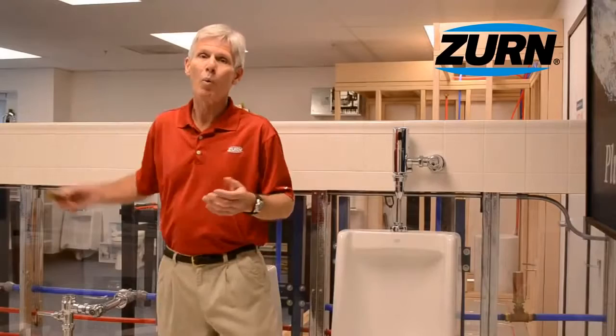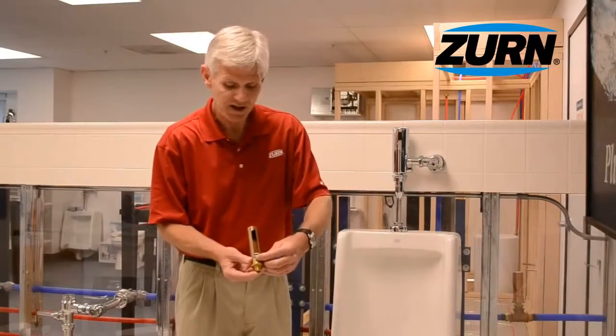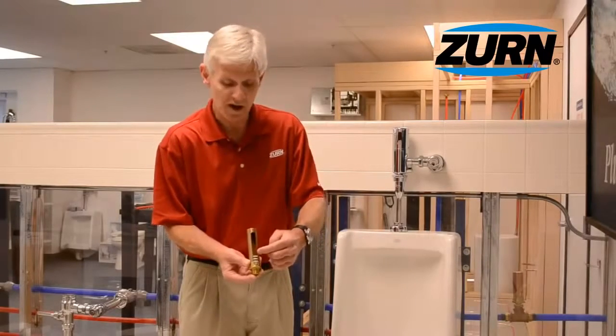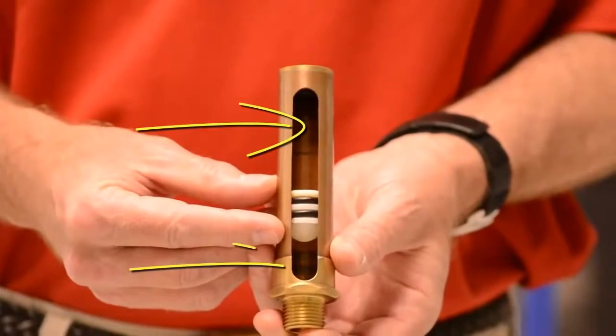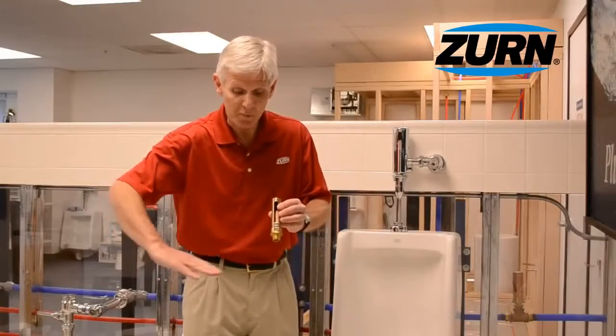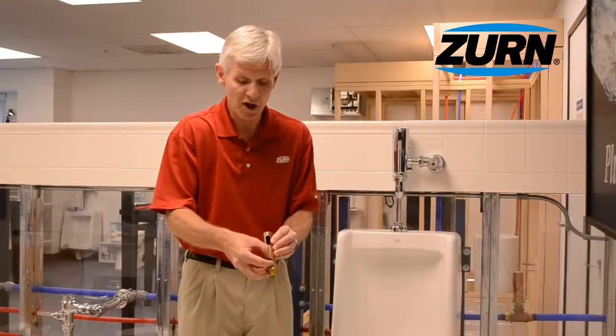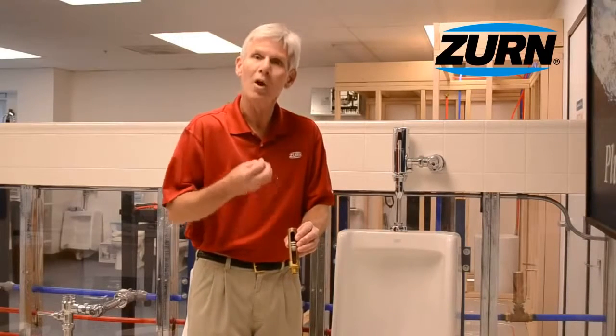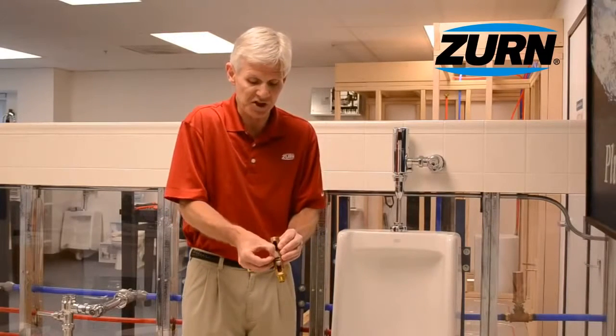To give you an idea of what a water hammer arrestor looks like internally, it has a piston that's sealed against the copper pipe with a couple of rings. Above the piston there's a charge of air, and below the piston it's exposed to the plumbing water. When the shock wave moves by the water hammer arrestor, the shock wave moves into the arrestor causing the piston to rise and compress the air. As that compression occurs, it's eating up the energy of that shock caused by the quick-closing valve. Once that energy is eaten up, the piston simply relaxes and waits for water hammer to occur again.